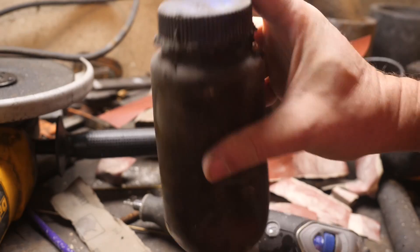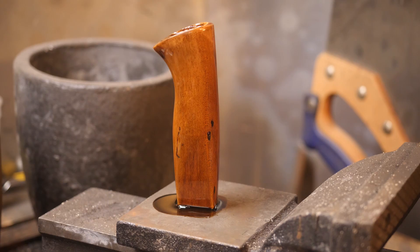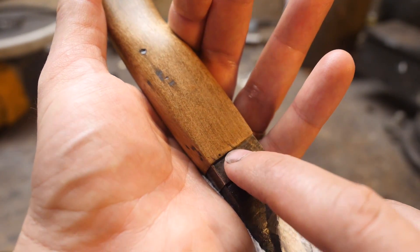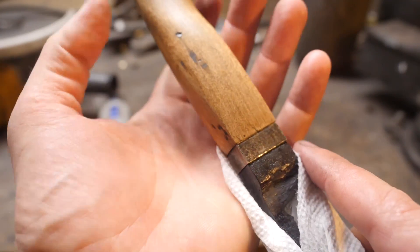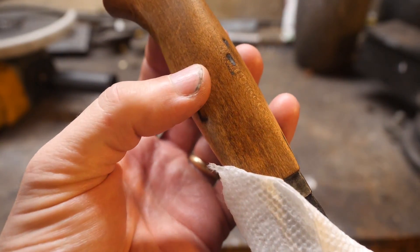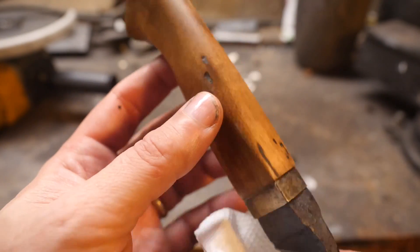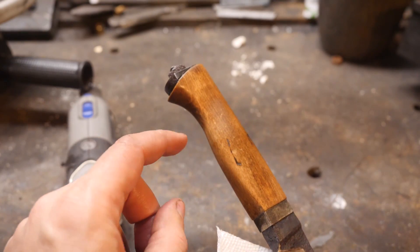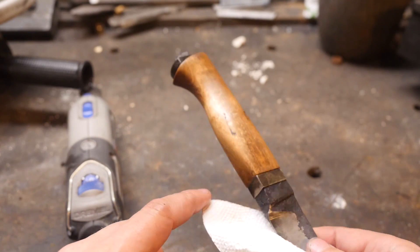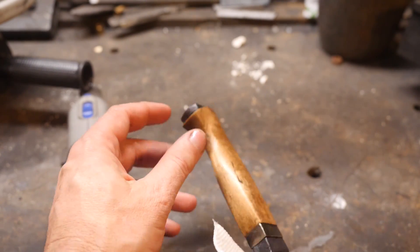It's into and then out of the Danish oil and it looks pretty good. There's a hole, some termite damage and cracks that are more readily apparent now. I'm going to add a worn look to the wood because of all these existing defects and the fact that it'll fit the overall rustic appearance we're looking for. So I've sanded out the stain in some areas, then restained it, which darkens the unsanded spots more. It adds a two-tone effect and then I've handled it vigorously with dirty hands before sealing it with some furniture wax. Overall it looks nice and well-aged or distressed now.